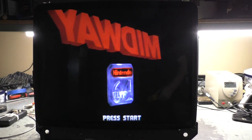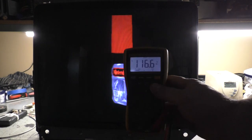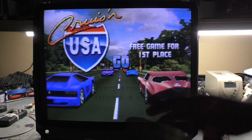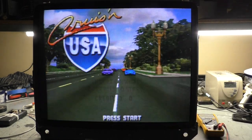Okay, so off camera, I played around with the B plus pot a little bit more, kind of showed it who's boss, and I was able to get down to 116.6, which is close enough, and we'll call that good. So now B plus is perfect on medium res and standard res, perfect enough, close enough. So now let's see if we can adjust it here, make it look a little bit better.